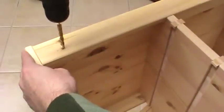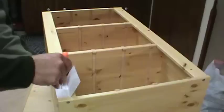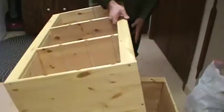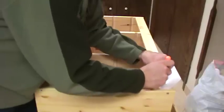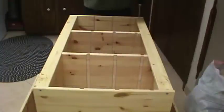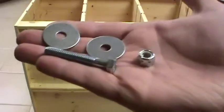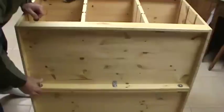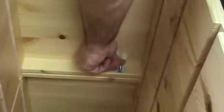Just mark the hole, come back with a drill, and clear that one out. Then do the same thing in the other three corners, then switch cabinets for four more holes. With four strategically placed bolt holes in each cabinet, bolting the units together isn't too difficult. I used five-sixteenths bolts, washers, and nylon lock nuts to assemble the two units into one. Those bolts are pretty well hidden out of sight.